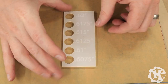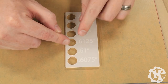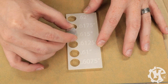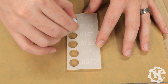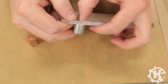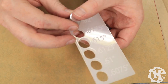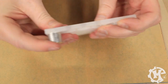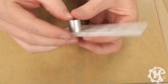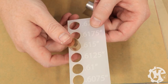Here's the gauge that I made. I need to figure out what size hole I need to make in the acrylic to put these metal dowels in. For the MDF projects it was 0.6125 — for this one I'm not quite sure. I'm going to test fit the pin in each of the sizes, see which one fits best, and go with that size. The 0.6175 looks right. When I put it in the 0.62 it slides a little too easily — it's more of a hard press fit and I want it to grip the material. So I believe 0.6175 is the size I want, and I'm going to adjust the design to that hole size and start making some squares.